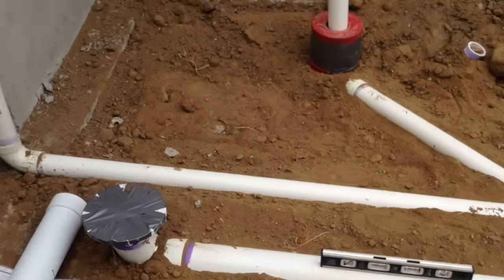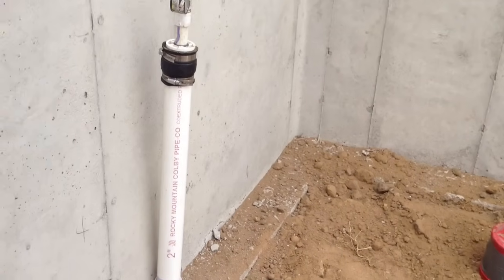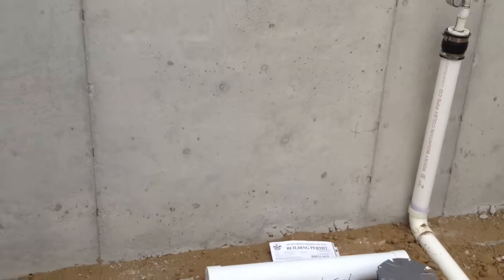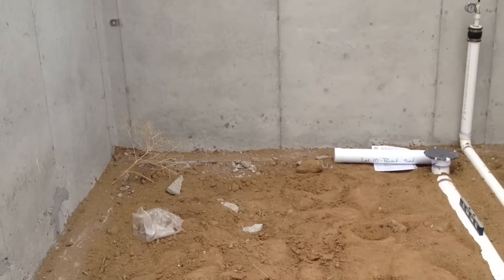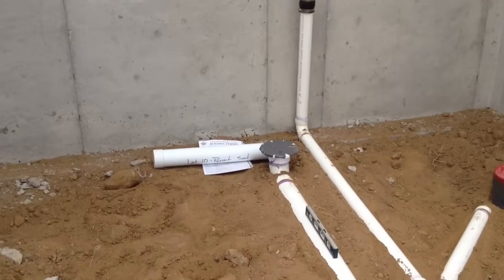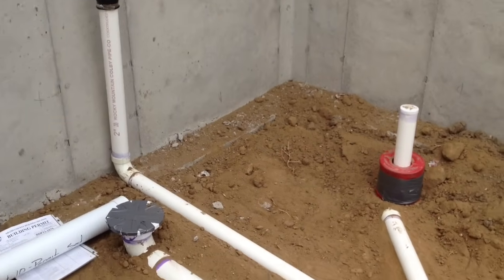So here we just put an elbow and flush out. It's a 3-inch line for the toilet and a 2-inch line for your drain. This vent line coming up — we'll tie a T in there that will run across this wall and stub out for a sink in that corner. You can see here's my other wall, and over there we'll have a vanity. That allows us to stub out wherever we want depending on what size vanity we put there, and it doesn't need to go underground anyways.